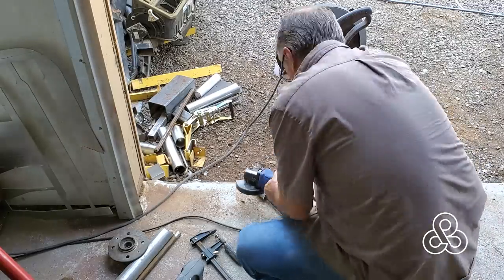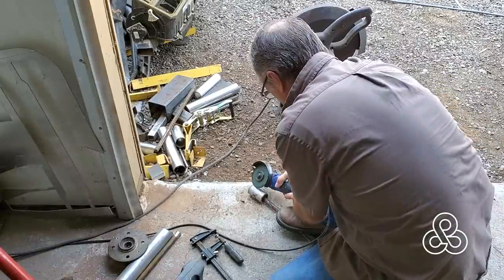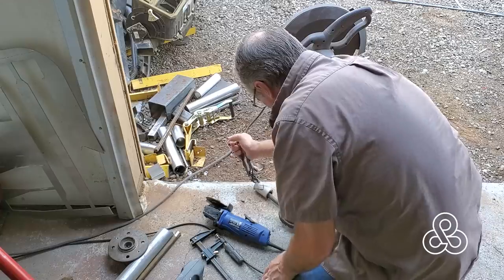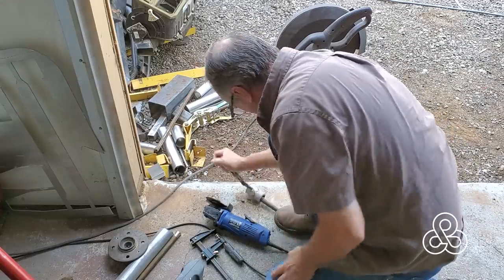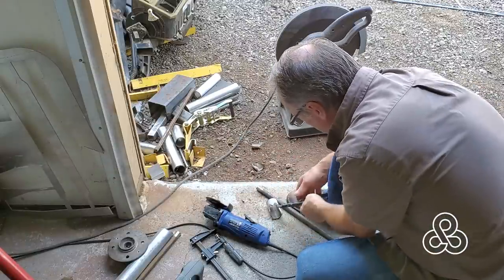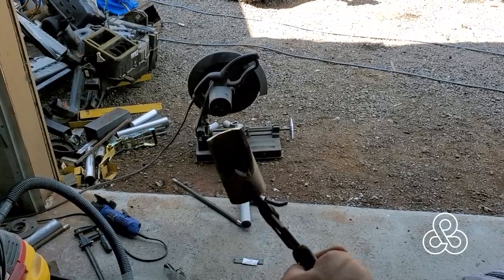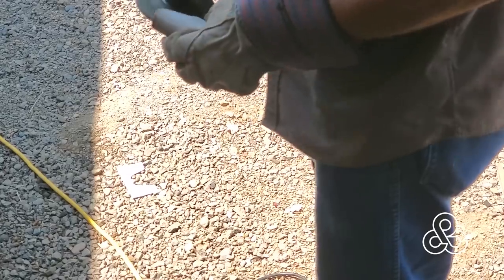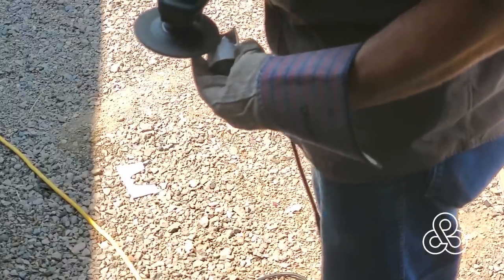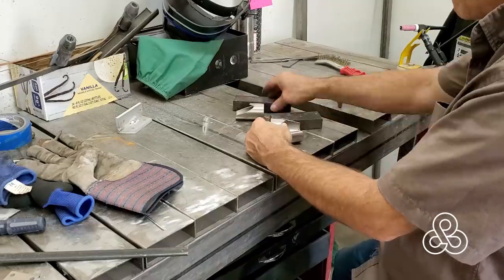Since I don't have a bandsaw that can cut this, I'm going to go ahead and just use an angle grinder and cut inside my lines roughly — and it is pretty rough. This is a little close-up, bad lighting, but you can see just kind of big hacks. So we're going to take a flapper sander and go back and bevel it off and get nice smooth surfaces, grinding it right up to our Sharpie marks.